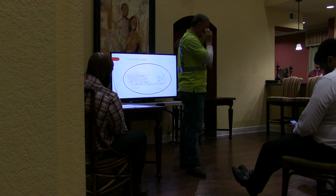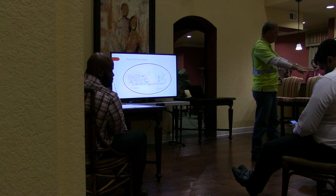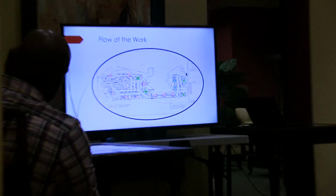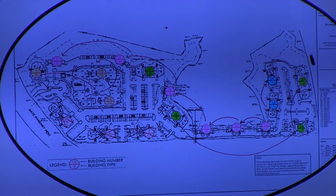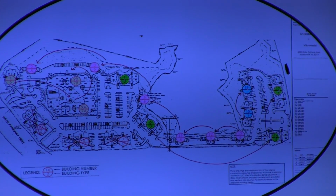What the engineer has allowed us to do is we're taking the deck off so we can peer into the cavity of the deck. And if there's no evidence of damage, then we don't need to take off what's called the lid of the ceiling. To the extent that we don't have to take it off, we clearly don't want to. But in some cases, the engineer is going to make us take off drywall lids so he can inspect the integrity of the waterproofing system we're installing.